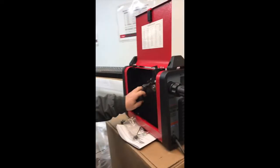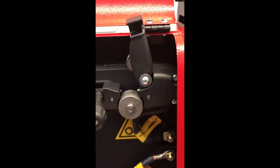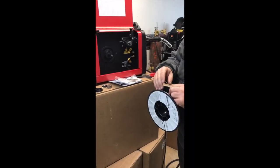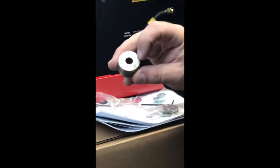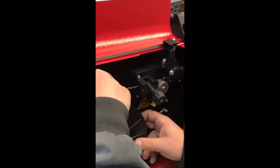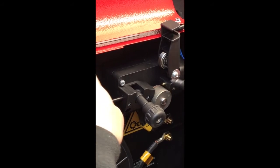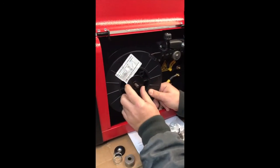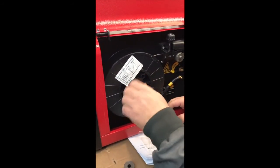Now if I'm going to run steel through it, I'd mount my steel wire. I'd push the steel wire in through this sleeve, and then you can see where that brass tube now sticks out — so you'll run your brass, silicon bronze, or steel, put it on there, clamp for pressure, and you're good to go. To load steel, I drop the spool on the holder, feed the wire through the first tube, and once I get to the back, you may need to use a pen or something to straighten it and get it through that second hole. Once it's through, just drop that down, get the pressure on it, push your reel up onto the piece — this piece is keyed so it's got to go a certain way. You don't need to crank it all the way down, just get it on pretty good and you're good to go.